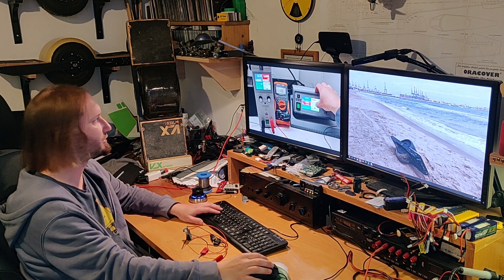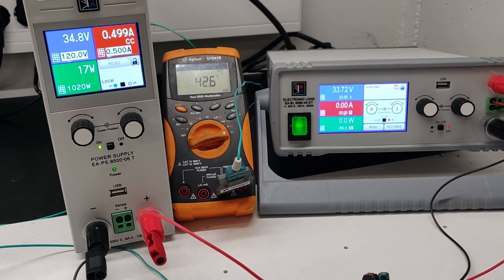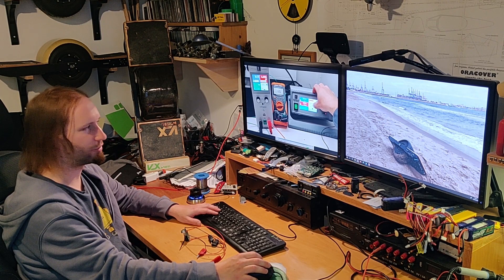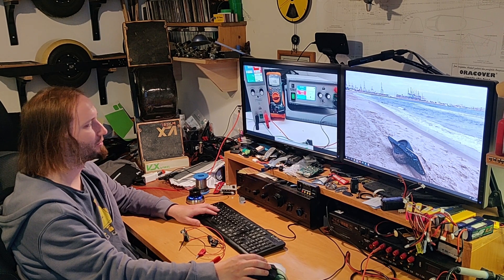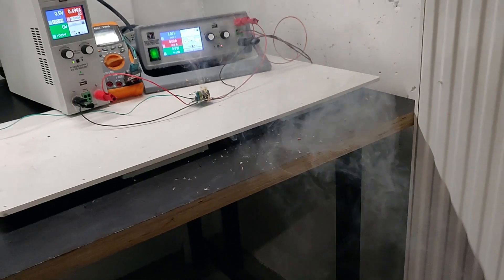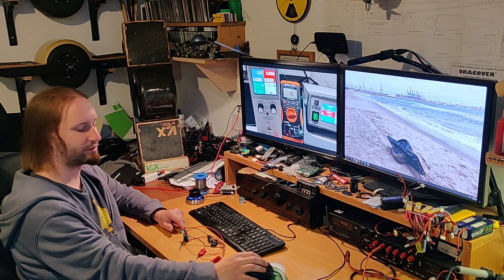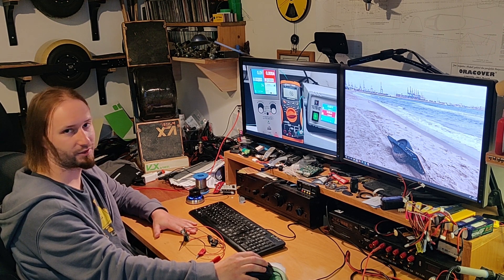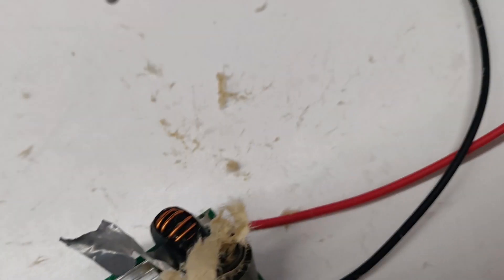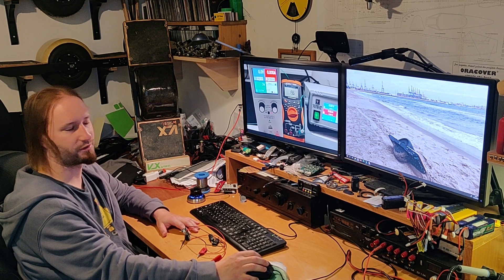At this point I lowered the input voltage because I'd seen my mistake. But what happened is the output voltage is not going down — that's a sign that something is not working properly anymore. With the voltage staying above 30V, the output capacitor couldn't handle that anymore, and that's where it exploded. Let's agree that the reason it exploded was actually me raising the voltage 10V above the 120V limit. So it's totally my fault.